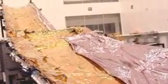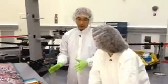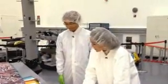These layers that you see right now actually will be coated with a vapor deposited aluminum. Okay. And that aluminum, which you see here on the underside of the thermal covers, is 99.99% reflective. So that helps a lot when we're trying to bounce all that thermal energy out of the Sunshield. Okay. Now the kind of pinkish purplish part is actually a silicon layer. And that's the one that's exposed to the sun? That's right. But we use the aluminum, the super highly reflective aluminum, everywhere else that we can to reject the heat. Great. Thanks a lot.